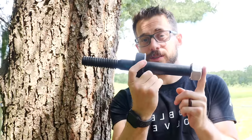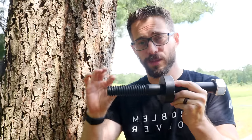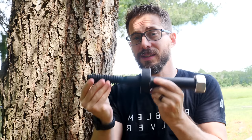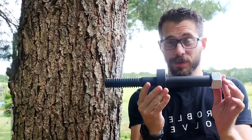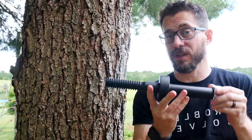This is a treehouse attachment bolt, and this is the standard for attaching tree houses to trees at this point. Basically you drill a hole through the bark into the wood and then you screw this whole thing in; the weight of your tree house then sits on the part that's exposed. This is definitely the safest option for a tree house and the healthiest option for the tree itself. This video is sponsored by Lowe's, but this is a specialized item they don't carry — most places don't. I had to find these online; I'll put a link in the description, and that website also has some great installation videos.